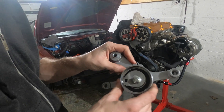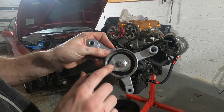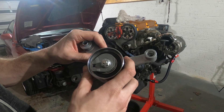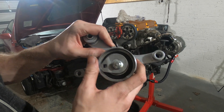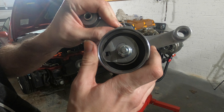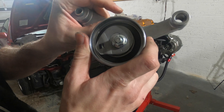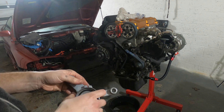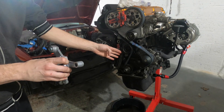Real quick, because it'll probably be hard to show you guys: you put a wrench in here, loosen this a little bit, and when it's on, you adjust the tension by tightening it and this piece right here will move. You want it all the way where this wire is like in the middle of it, and you tighten your bolt down and you'll be good to go. So that just bolts right in here and it replaces this.